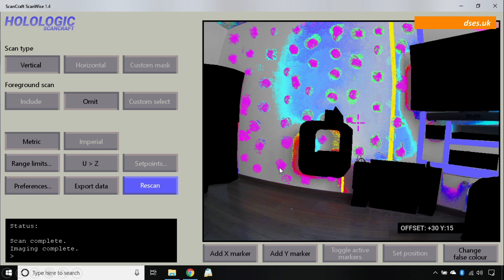Now, I mentioned it recorded the distance earlier. Let's say I wanted to install a socket outlet on this side of the fireplace with the cable routed behind the plasterboard from above. I can see there's a potential path down here halfway between the fireplace and fish tank which, if I put the hole in the wall and rodded up, would miss any obstructions such as the adhesive globs. If I place a vertical reference line here at the edge of the aquarium — it's a bit distorted due to the wide-angle lens, but I know this is a straight line — it makes a very good reference point. If I then click where I think a new socket accessory could be located, the software shows me a line up the wall and tells me I'm about half a meter horizontally from my original reference line. I can set multiple horizontal or vertical lines and reference points — up to 25 points per scan, I believe. The point is, I can see where I need to drill and rod to avoid any obstructions.